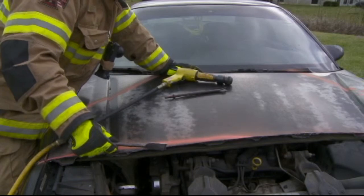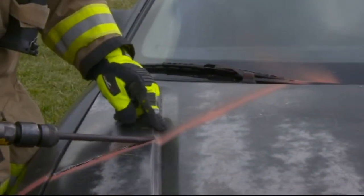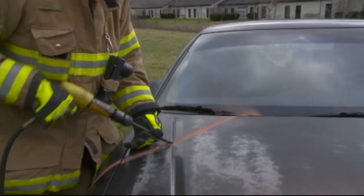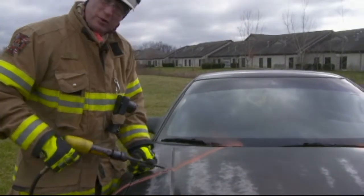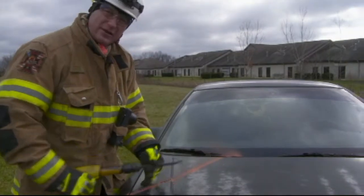So you've got to make sure that you're gliding appropriately, keeping that top corner above the cut line. When you hit folds or bevels in your body panel like this, this type of bit may not accommodate a full cut through and a return cut on the opposite side. You may need to pull out switch blades, go to the chisel bit to accommodate all those angles, and then go back to the other bit.